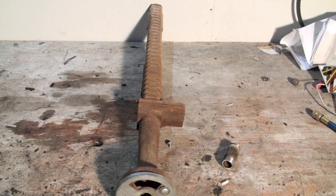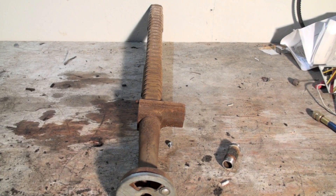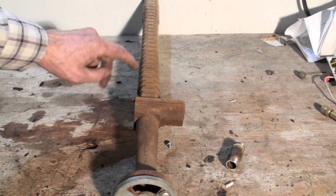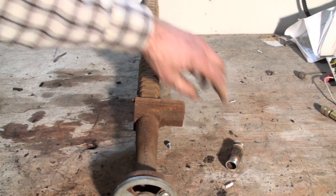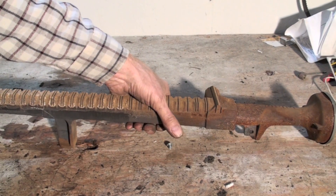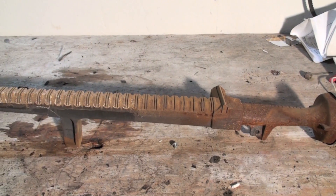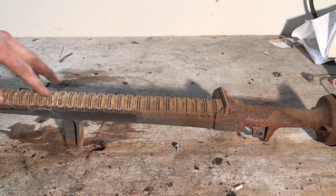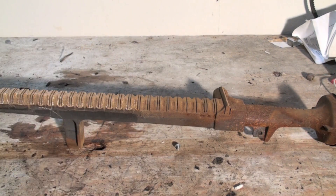This is one of the burners — these are cast iron. We had a delayed ignition on this burner. One of the things we'd normally do during a service is pull these burners out and run a hacksaw blade through here. I'm going to quickly show you how that's done.